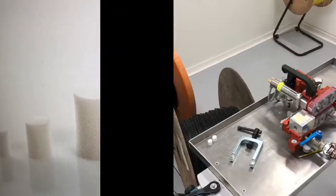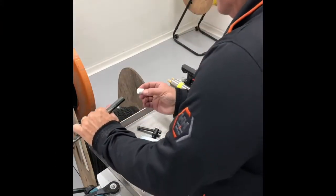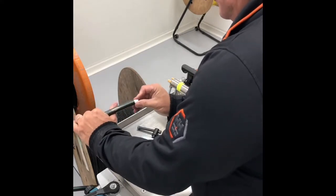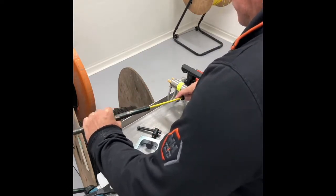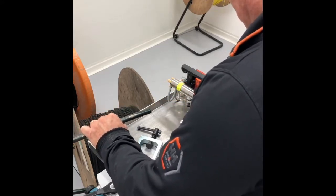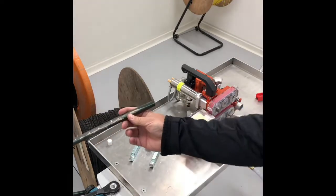One of several enemies in fiber blowing is water and dirt inside the ducts. For that reason it's important to clean and to lubricate ducts. The easiest way is to place a sponge provided by Jetting inside the ducts and then send it all through the distance with low pressure air. When the sponge comes out clean and dry, it's time to lubricate.